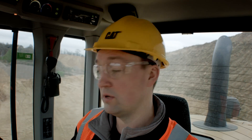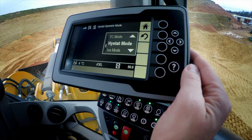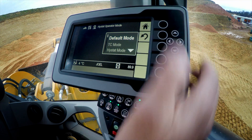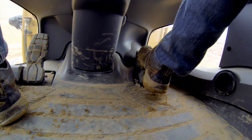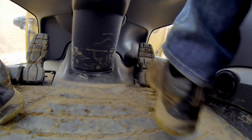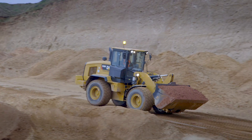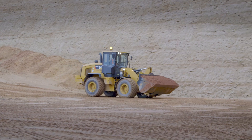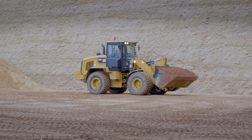Let's start with default mode. Into our display, navigate to machine, into settings, into high-stat operator mode, navigate to default mode, and let's put this machine to work. I'm going to click it in gear, go to maximum RPM, range 3, and as I hit the crest of the hill, I'm going to take my foot off the gas. And here you can see the coast out characteristics in default mode.